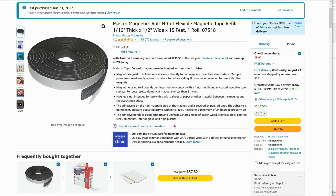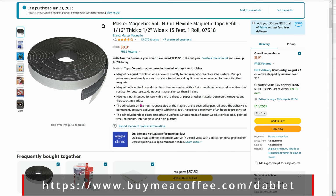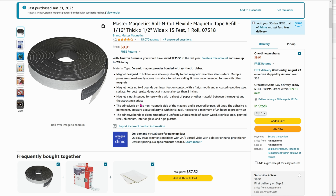I happen to have a bunch of these magnetic stickers. These are actually really heavy stickers. If you have one lying around, you can actually use them as weight, or use anything else and double-sided tape, to be equivalent in weight to the one that you 3D printed. Once you've 3D printed the parts and have something heavy to stick onto the blade, go ahead and follow the steps that I mentioned earlier, which is finding the problematic blade and then sticking the weights on.